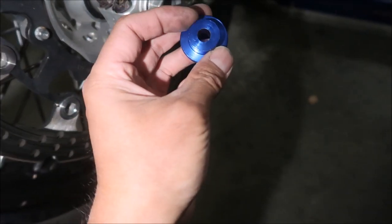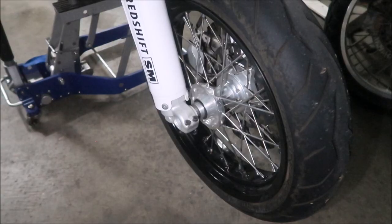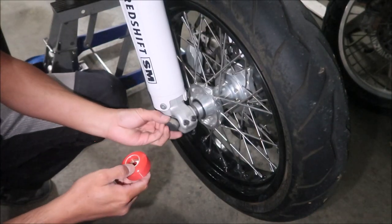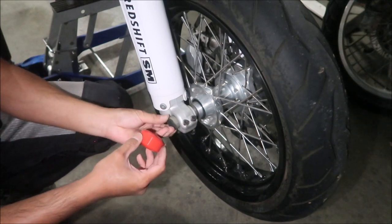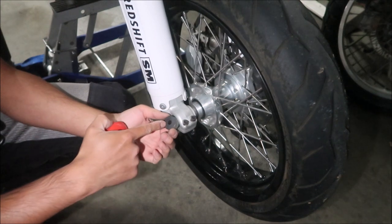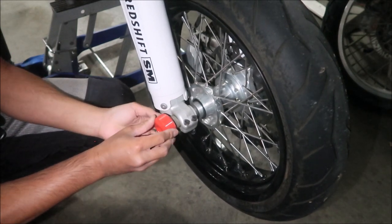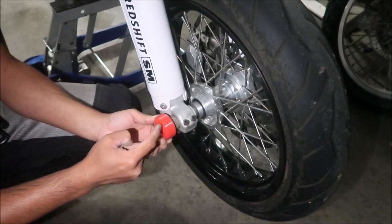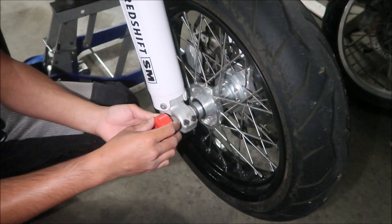The hole needs to be a little bigger so we'll make it bigger. We're going to put this on the lathe and turn this part down to the same size as the bore. That's going to sit in there. We need it to fit on top so it spaces the puck out — without the spacer it would touch the fork leg. With the spacer it sits nicely there, and now the skateboard wheel is spaced to protect the bottom of the fork and the fork guard.